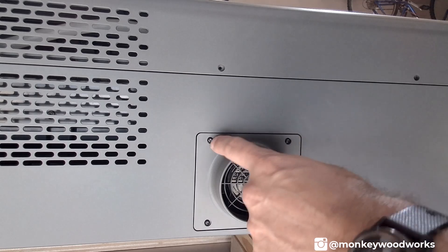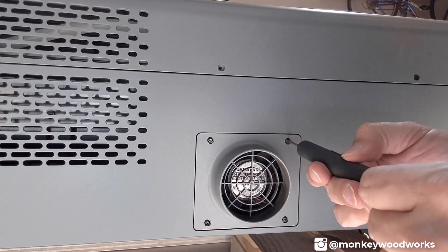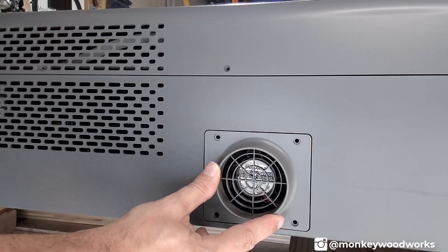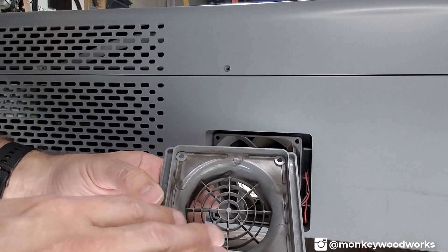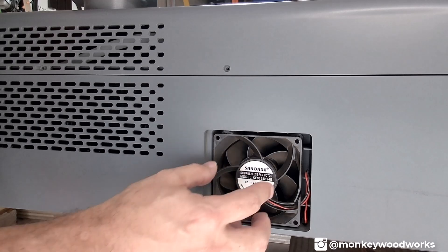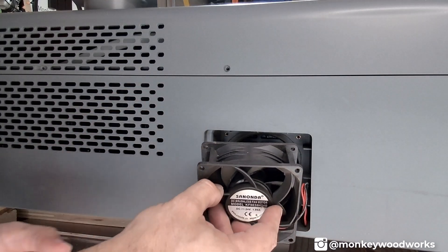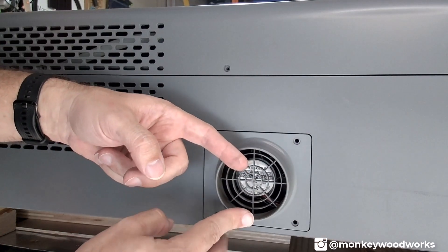Here we are on the backside. Remove these four screws to take this cover off — this is where the power screwdriver really comes in handy. With all four screws removed, take off the cover. When you flip it over, you can see what I mean by it needing to be cleaned — there's a lot of soot inside, and you'll need to wipe it down with a towel or Q-tip. The fan itself will also need to be cleaned from time to time. It's easy to remove — just slide it out and you have access to clean the fan front and back, and also clean the port. Once clean, slide it back in place, be careful with the wires so they're not getting pinched, insert your screws, and screw it all back.